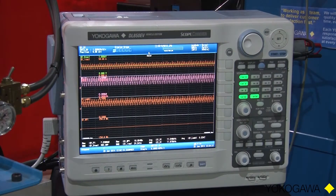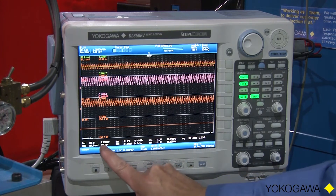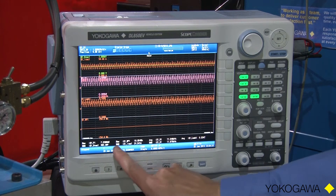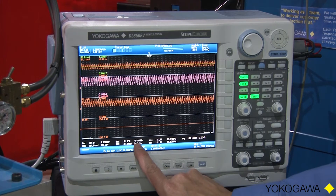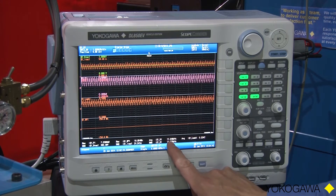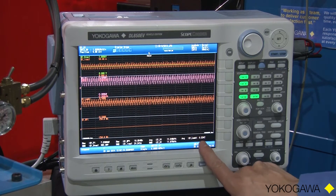Here are my test results from the welder measurements. As you can see, I have measured a number of things here. My power during that welding session was 7.2 kilowatts maximum, and my watt hours is 19.85 watt hours for about 20 seconds worth of the welding session. My apparent power on average was 11.5 kilovolt amps, and lambda averaged out to 0.2347.